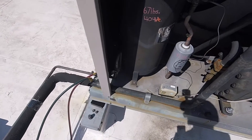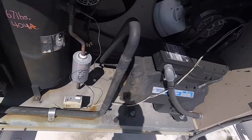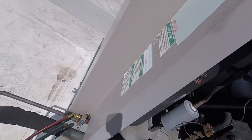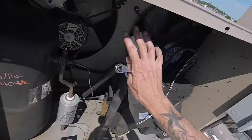Now when this pumps down, we'll start it up, pump it down, get all the gas back, and everything should shut off on low pressure. You could also shut it off manually here if you wanted to, but either way it doesn't matter — as long as it's somewhere where the gas is going to stay in this unit, in the receiver and in the condenser.